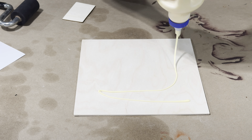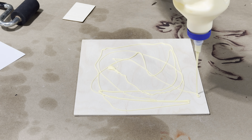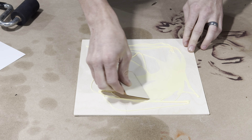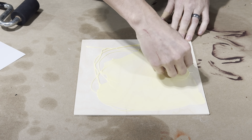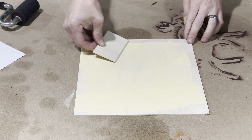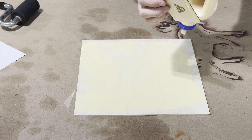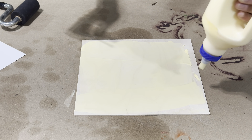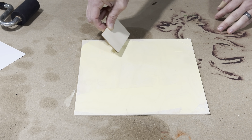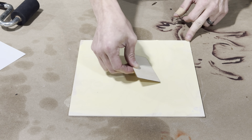So next, jumping over, I'm using Titebond II. You could use any Elmer's glue, but Titebond II tends to be my favorite — it doesn't dry too quickly but gives a really good bond. Titebond III works just as well and is waterproof. I'm using a little piece of scrap wood as a card scraper, which works great because you can move the glue around quickly and evenly before it starts to dry. That way you can get your picture on soon and get it attached before your glue starts to set. If you're doing something larger or more delicate, you can use an extended set time glue that Titebond makes — it'll give you a little bit more working open time so you're not rushed.